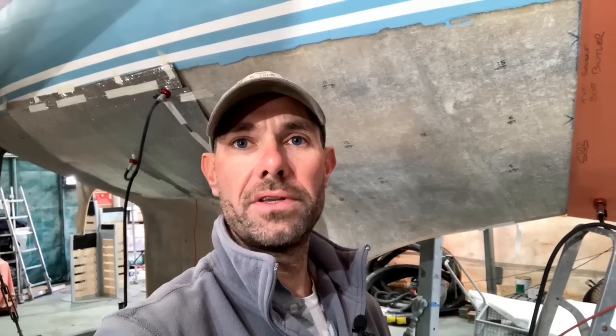So you don't have to use heat and vacuum to dry out a hull that's osmotic, but it speeds up the process and there are some advantages to doing so. Getting some heat into the laminate helps the liquid and the chemicals to come out because you're not just drawing out seawater, you're drawing out byproducts of the original manufacture of the hull laminate. You're trying to draw out the hygroscopic chemicals that were in the original mix of the polyester as it was put onto the boat.